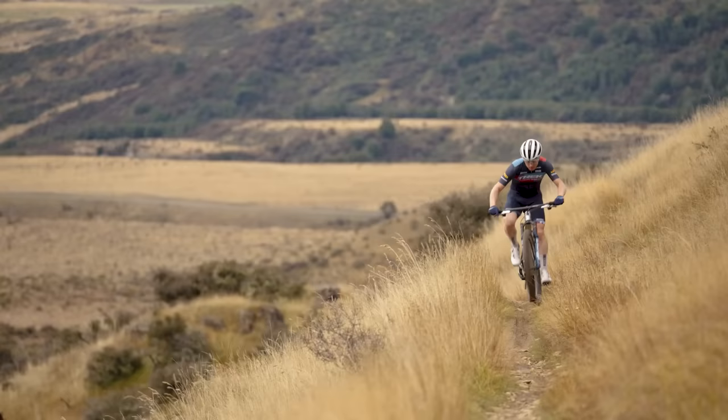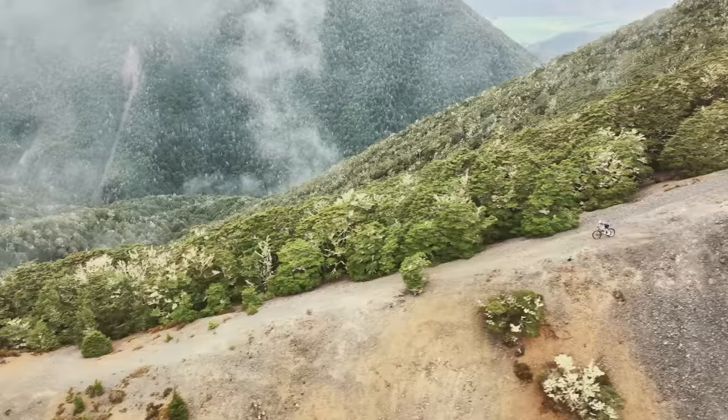Another thing that is really neat about the RockShox strut is we have etchings, like you mentioned before, to help riders set up their sag, which on a high performance, short travel bike, your sag is critical to what's gonna happen out on the trail. So our preferred setup is 25% sag. We feel like that offers a really great blend of pedal efficiency and small bump compliance, and also capability while descending. But we found through all of our testing, there's a really useful range of sag.